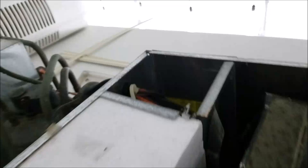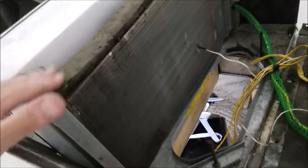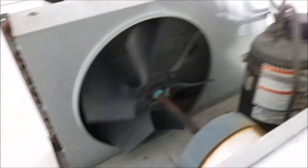There's another screw right here - get that out of the way. I've got some putty I'm going to re-putty around these lines, just try to get everything tightened up. But once I get the coils clean and put things back together, I'm going to put some more tape on it too, just to make sure we're not sucking any outside air into the cool air stream. Try to get this cleaned up good and do a few things, see if I can't get these gutters hooked up.